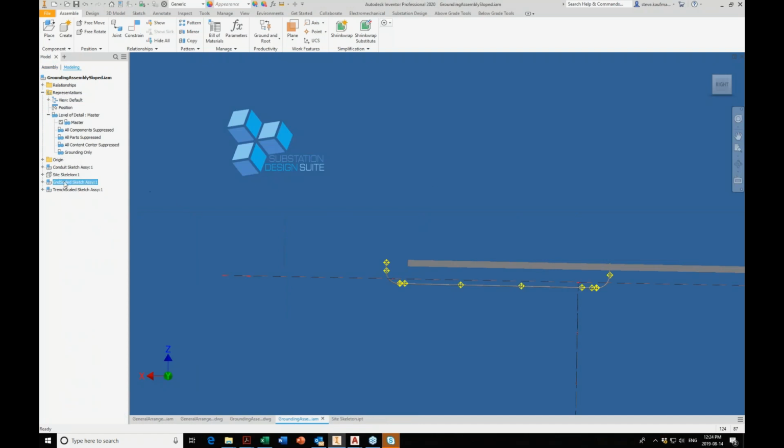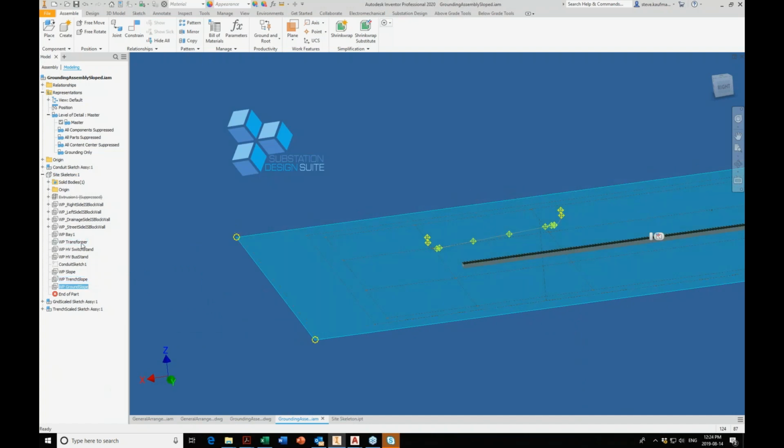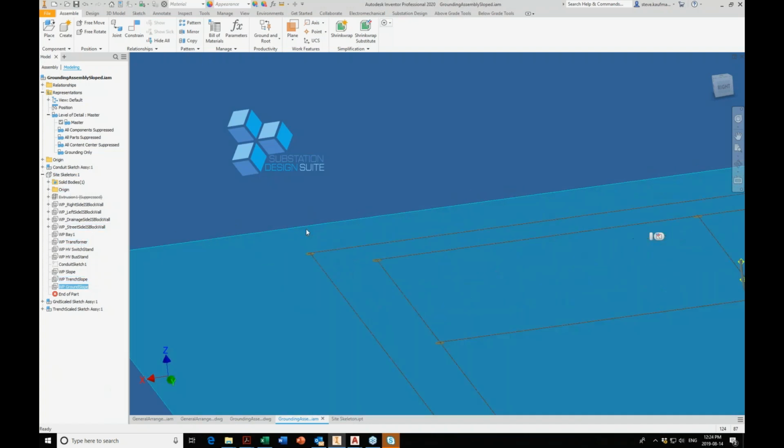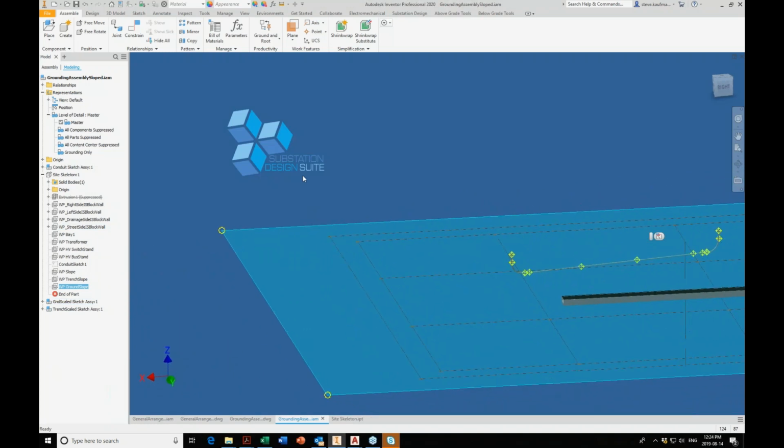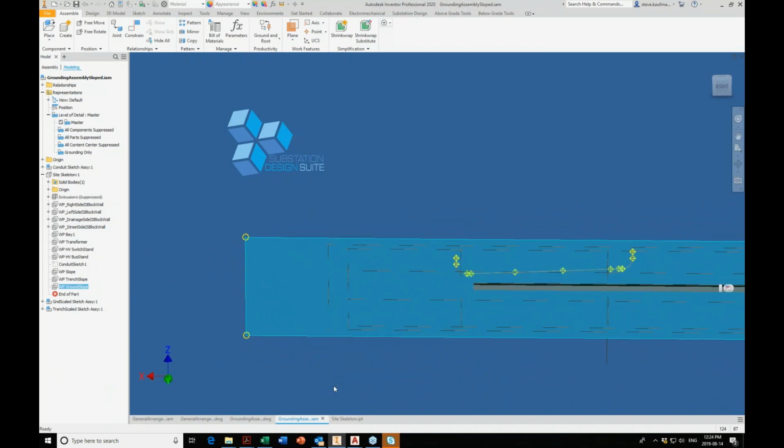So we have the ground grid assembly, then we place it in the next higher assembly, sorry guys, where we attach it to the skeleton that has the slope. So in here you can see in the skeleton I got a trench slope and a ground slope. So I placed it on the ground slope, and now I have a slope plane with my reference. Remember, I kept a reference on a point in my sketch, which is right up in here. I have that reference and I made all my planes sloping on that point. And then I can offset to what I need it to be.